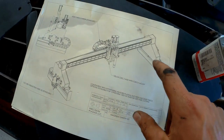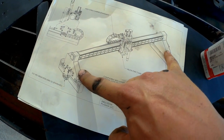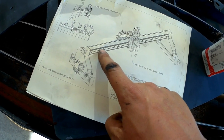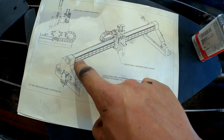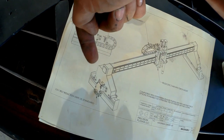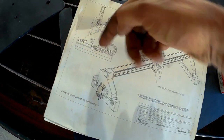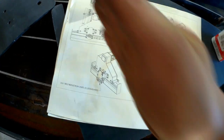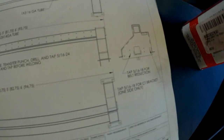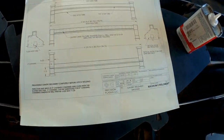Ultimately, this is what we're looking for — we need these two side assemblies welded together, and we need this crossbar that goes across, just in case that wasn't obvious. Then there's this V-rail assembly that gets bolted on there, a lot like the cold rolled steel with all the bolts in it. Also, what you can't see back here is there's a little tube that gets welded along the back side, and I think that's to keep it rigid as it travels up and down the gantry.